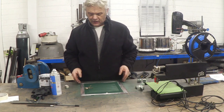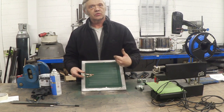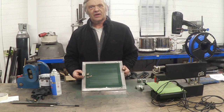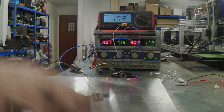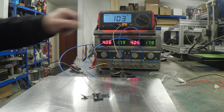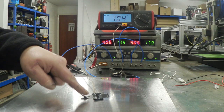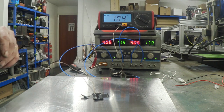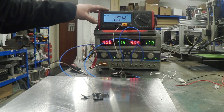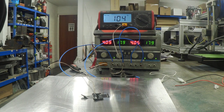We've got a little bit of cleaning up to do — attach the block by drilling through to fix it, then put the wires in. Okay, so here it is on test. It's been running for eight minutes and the plate is now 104 degrees centigrade — I'm not going to touch it. There's the temperature sensor going through this meter; I was asked to display the temperature readings so I've set it up so you can see what the temperature is.